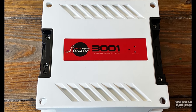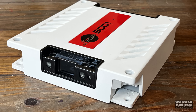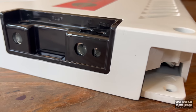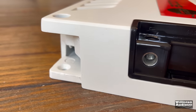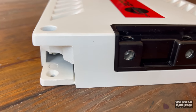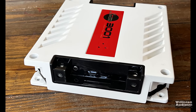Let's get out the Cutco and take off the plastic for a closer look at the amp. Overall, I dig the color combination — the white heatsink, the red sticker, and the black end caps look really cool. The only problem is it's really hard to read the black ends where it has the connections for the amplifier. You can see the power and ground connections, but it's so hard to read what is what. There's also a fuse there, and unfortunately the connections are 4-gauge.